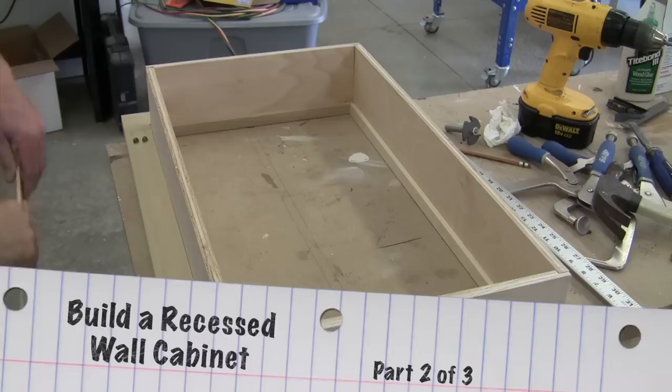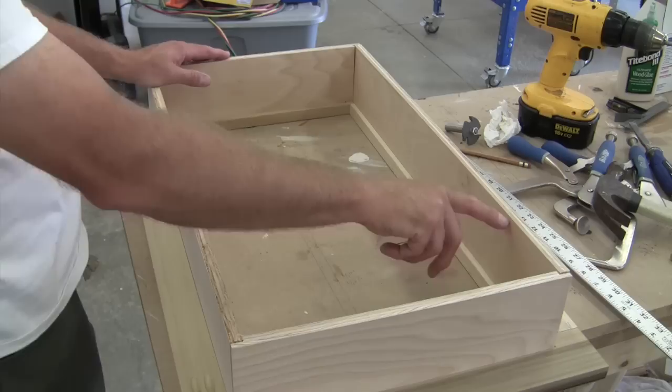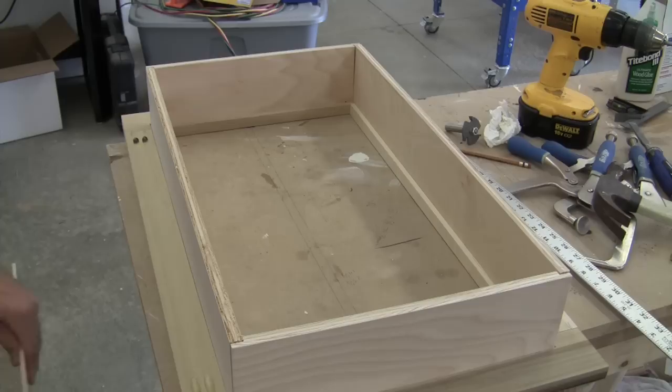What I normally like to do when I build the backs of these boxes is come in with a slot cutting bit on the router and offset about a quarter of an inch in, then cut a quarter inch slot all the way around the perimeter. Then take a piece of quarter inch birch plywood and just slide it into the slot. It makes a really nice and really strong connection and it goes together really well.